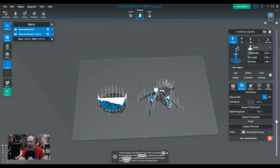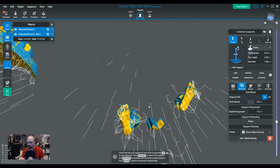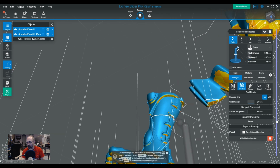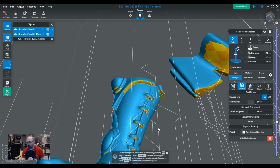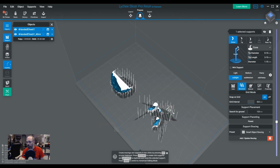Now for the Ifrit character, are we done? I mean, we did the feet. Like I said, you're going to do perimeter around the feet. Then you're going to want to go and take a look at any island that you have supported. And you're going to want to say, okay, does this need another support? Do I need to add more on these? And as you do that, just make sure that you're not adding too much weight on supports.